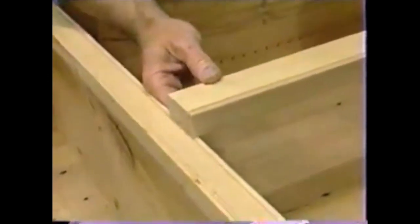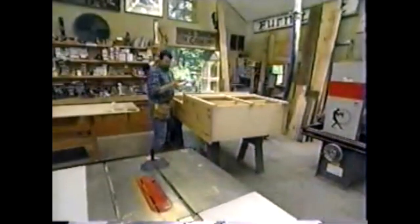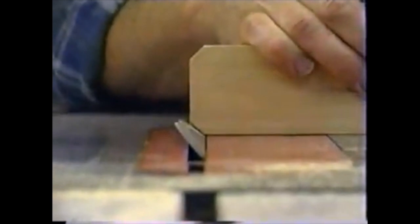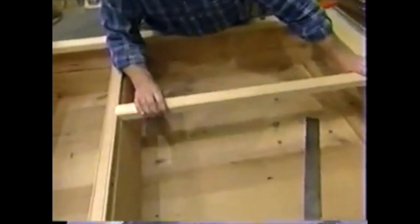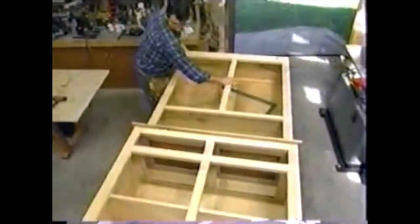I've fitted all the pieces together and the last piece is the center stile. I've made holes in the back corresponding to the shelf pin holes in the side using the same jig. With the piece cut to the right length, I make a miter cut and nibble away the bead material. To fit the stile into the notches, I miter just the bead corners using the same setup. I'll assemble the frame with pocket screws and attach it to the carcass just like I did with the lower one.